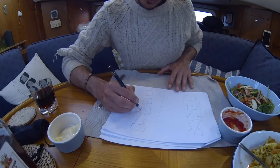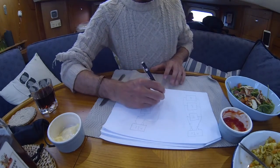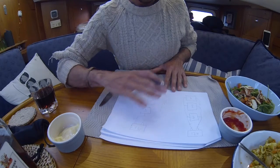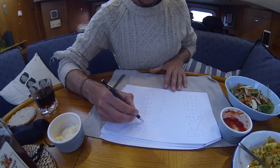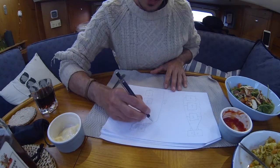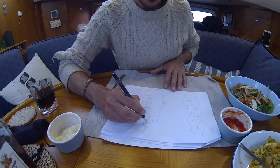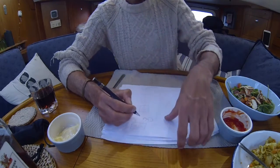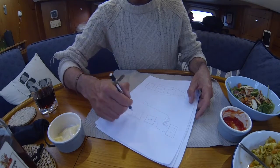The problem with series is it goes 12 volts, 24 volts, 36 volts — you end up with 36 volts out of the last panel. But the amps stay low, so there's no need for thick wire. All the wire between panels can be nice and thin, all the way back to the battery. However, you can't put 36 volts into a 12-volt battery, so we use a little special box that takes the high voltage and converts it back to 12 volts. Only that final short wire — about a meter in our boat — needs to be really thick.